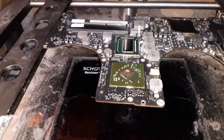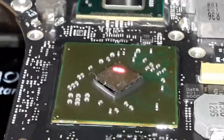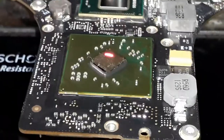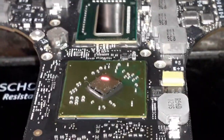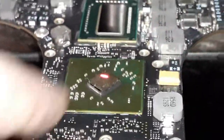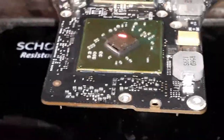I did not put the tin on top of the chip - I forgot. I always put some tin on top of the core to protect the core against the heat from the top heat element. Right now we have the board here in pre-heating mode. As you guys know, I do the preheat first - let the board get hot before I start the reflow because I want to avoid any bubbles on the board or on the GPU itself, and problems on the layers.